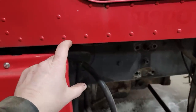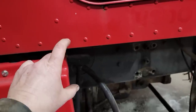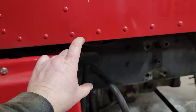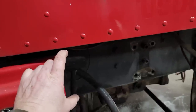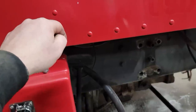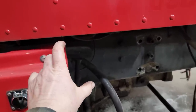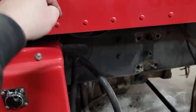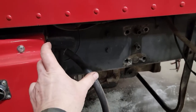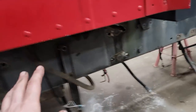I never put my double frame straight up and down, or a liner at a splice or anything like that, because the way I understand it is when you put a liner or double frame on, if you have the cut straight, you have that compression on the top and the bottom working at the same place, whereas if you offset your cut at an angle, now this compression is working on one part and it's here, and it spreads that compression across the frame a little farther. So that's the plan there.